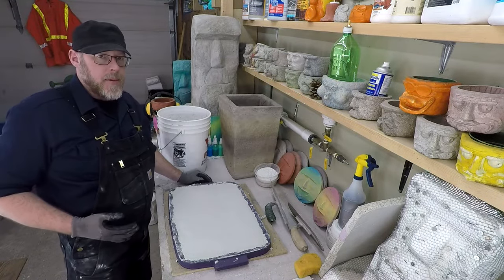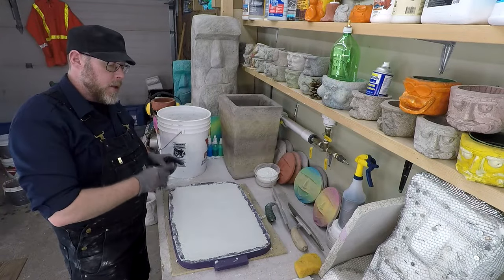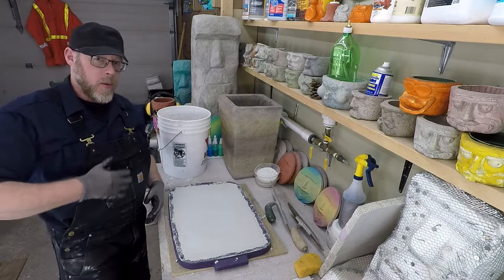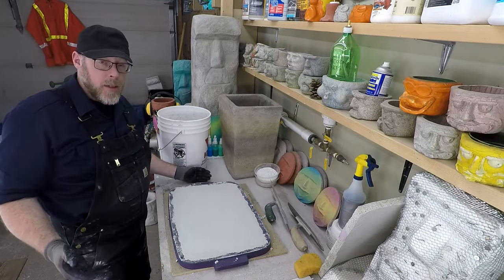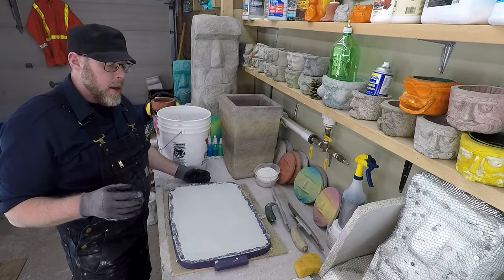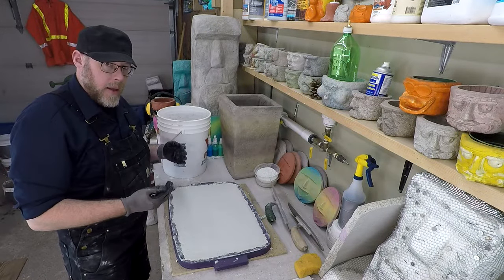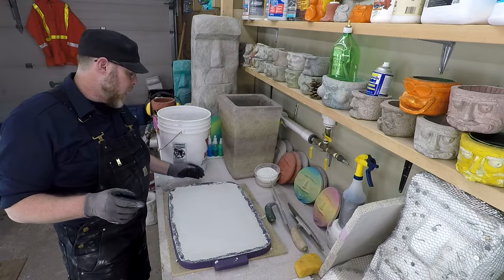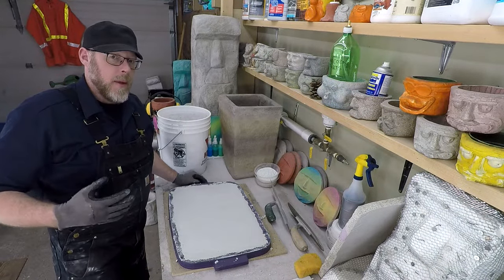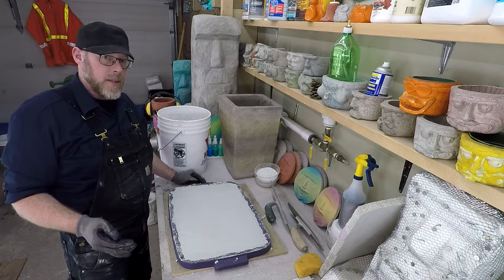So what is so important about this water curing process over the first three days? If the concrete dries out entirely and all the water evaporates, it shrinks prematurely. It's going to do this anyway — that's the reality — but it shrinks early. If the concrete is not strong yet and it's exposed to forces, it's likely going to break in ways it wouldn't have if it had more time to achieve strength first.